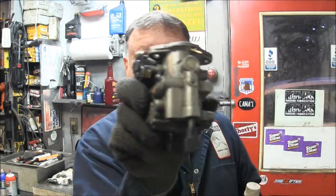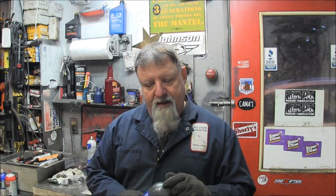89 carb because it's all aluminum and everything, whereas that one has the plastic top. I still have not cleaned this one yet. It's next. The reason it's important, and I need to paint it out, is because to put on or take off a carburetor on this motor, you have to remove the electric starting system or you can't get to the right-hand carburetor nut. So I'll want to clean this up and get it on there and give it a test run.